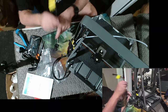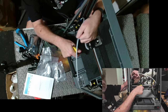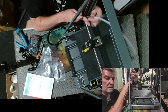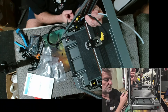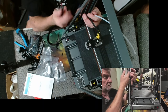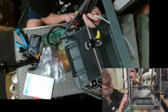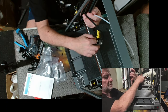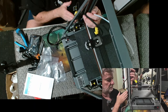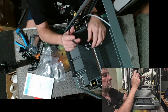This cable will come through here following the Bowden tube. The reason we have a Bowden tube on a direct drive printer is just to guide the filament so it doesn't get caught on stuff. It makes it go a certain way. But it's got to come through this filament run-out sensor — your filament loads up through the sensor, goes through the Bowden tube and gets drawn in from the print head. It doesn't get pushed like on a normal Bowden system.